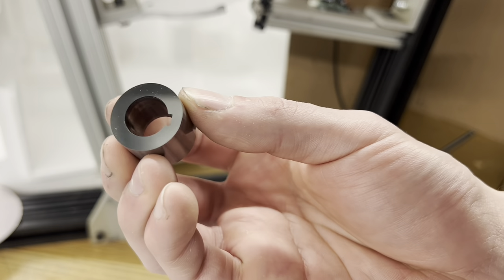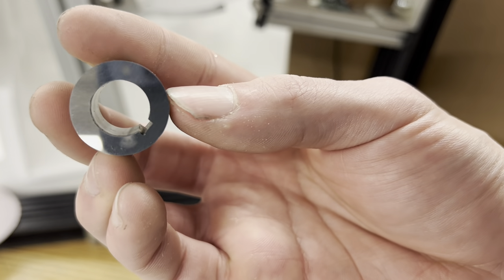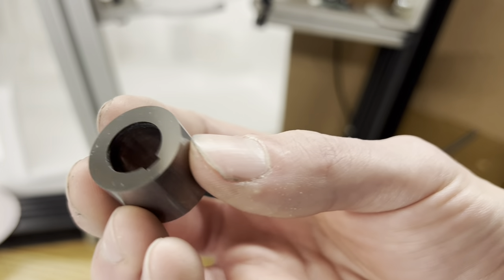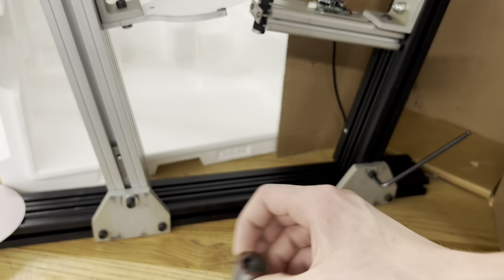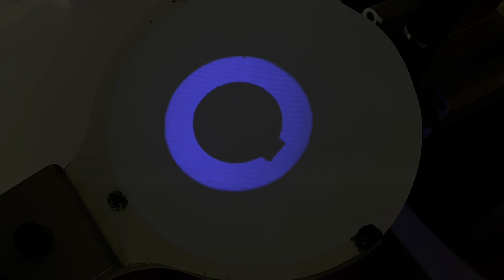The other side here was done with two and a half micron diamond on the lapping plate with a little bit of five micron contamination there. And that looks pretty decent. As we'll see in a moment, this actually ended up being a lot flatter. Let's set up the interferometer and take a look. So we're set up here — I think I've got the focus and exposure dialed in to where this will be remotely visible on the viewing screen. You can see when I put our part underneath the laser, we get a projection of the reflection back up on the viewing screen. This is the good side that we lapped on the homemade laps, but first we'll look at the other side which we lapped on the diamond film on the surface plate.